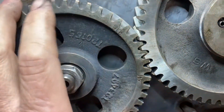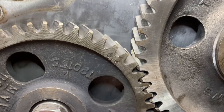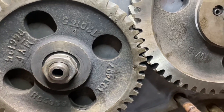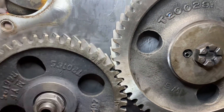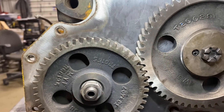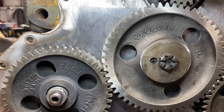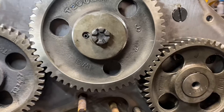Over on the injection pump gear, there are a couple of markings: a four, and a three and six right next to each other. If this is a three- or six-cylinder engine, that's the mark you use. For a four-cylinder, use the four mark. On other John Deere engines there might be a six and a six-A, so you have to check the service manual — always pay attention to what you have.